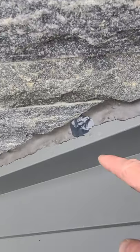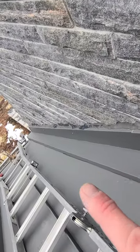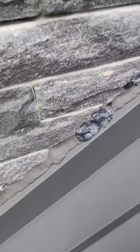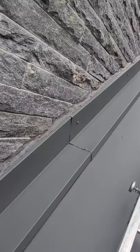I'm going to put pictures into the email as well, but these were basically pockets that I popped — they were retaining water. There were a few areas down there that had some air bubbles in the caulking; what happens is they eventually pop and hold water and may even get into the building somehow. The longer caulking areas were peeling away from the stone, so I addressed those issues as well, and that's about the extent of it.